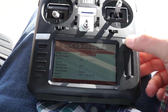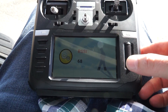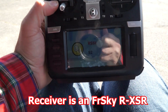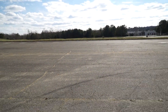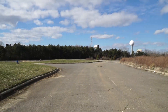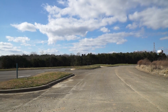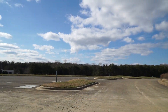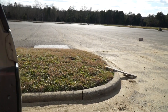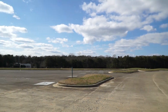I'm going to hit model, go up to range, hit range, and now I've got an RSSI reading. Let's get going. You can't see squat, but it's dropping: 50, 49, 47, 46 — keep going — 35, 34, 33, zero — stop. We got an additional row out of it. Last time we were at that blue post, and with the old antenna we were way down there. We'll come back and talk measurements.